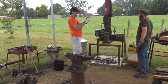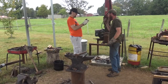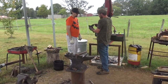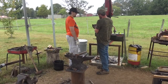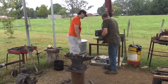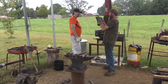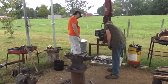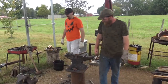We've got some billets here that didn't cooperate, and some of them did. Some of them just got tossed aside. They're definitely fixable. See this one? The eye's just cocked in here. I can take that, put it in the press, and straighten the eye back up. There's a little piece of 1/8-inch plate under this side. Push that down and it'll push that eye back straight and flatten it out. It's just that when I'm in the moment and one comes out a little crooked, I toss it aside and grab another. We'll get it later when I'm bored.